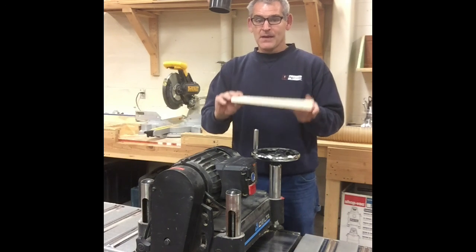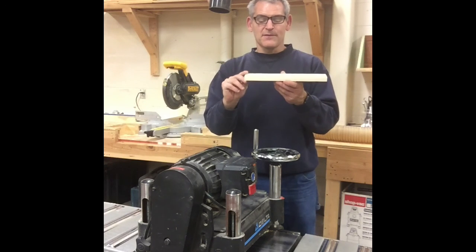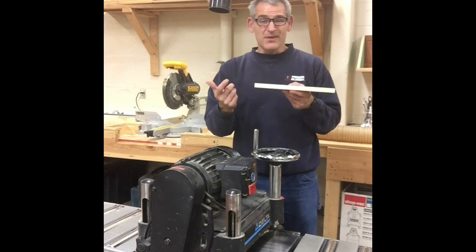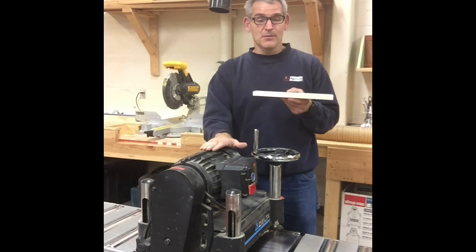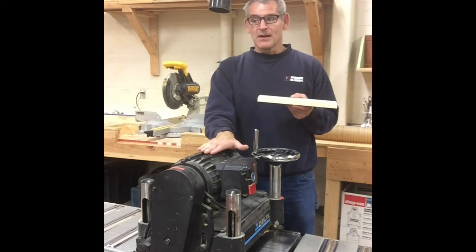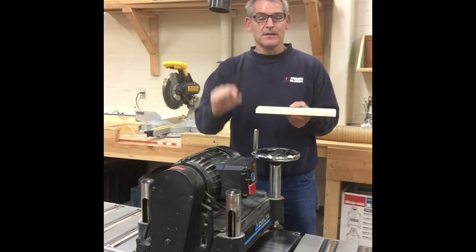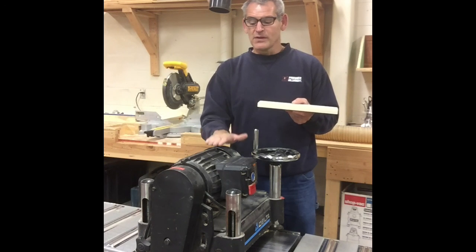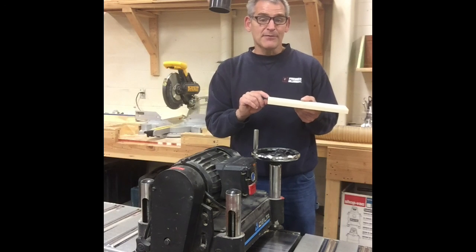The board has to go with the grain. You can plane down quite thin — this is a 5/8-inch board, and we can go all the way down to about an eighth of an inch, maybe even 3/16 of an inch. Look at your owner's manual or ask for guidance on this particular machine, as all planers have a minimum thickness. Check each particular machine before you go below about a half an inch.